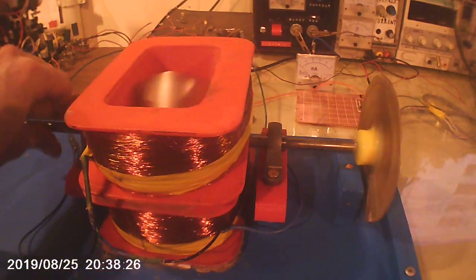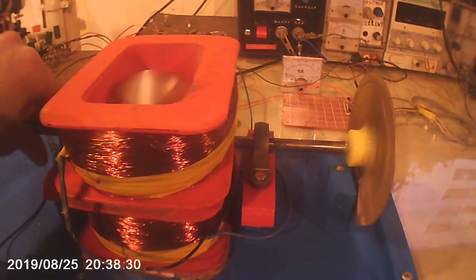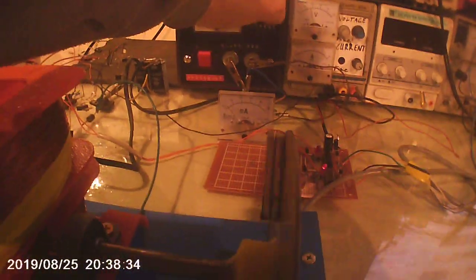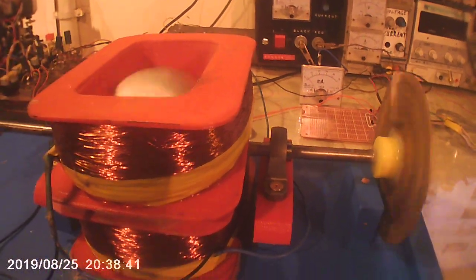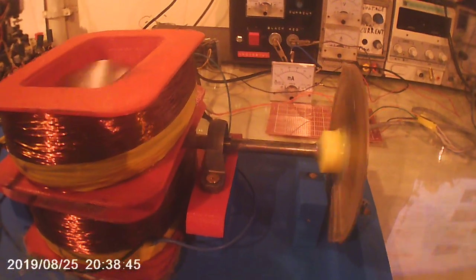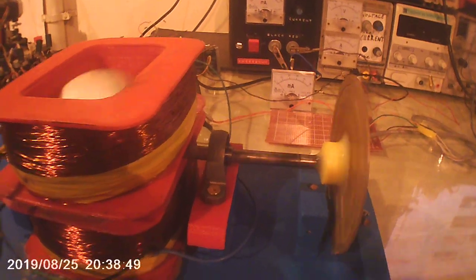The downside is I've got to swing it back and forwards a few times before it finds its equilibrium and it's okay to start. So I'm going to spin it up by hand — it doesn't weigh very much — then turn on the power supply and off we go. It seems remarkably recalcitrant to begin with; I haven't quite worked out why — oh, it's the large capacitors on the input. Okay, got to charge them from scratch.